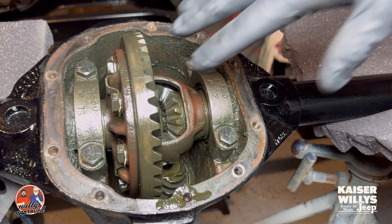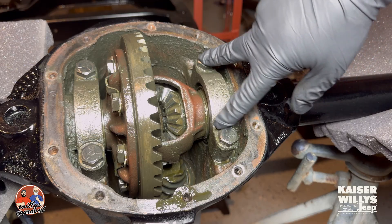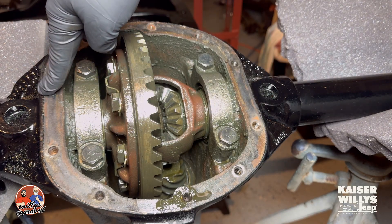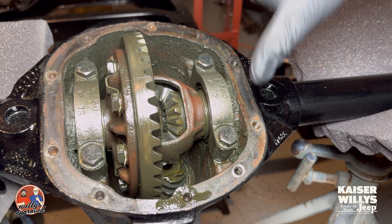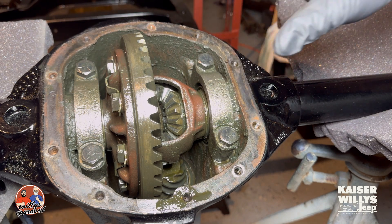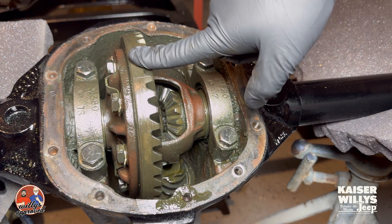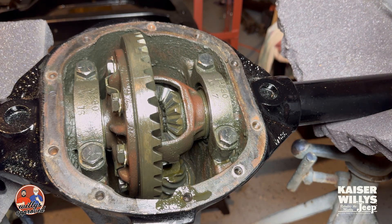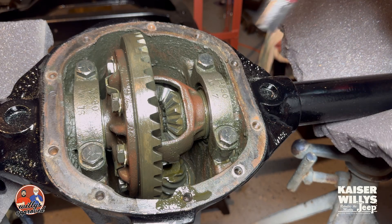This carrier is being held in by two collars, one on both sides. The orientation of the collar is important, so what I would say is before you do anything, take photos. I do that anywhere and everywhere that I do any sort of building or taking apart. So that being said, we've already taken a photo and we're going to go ahead and remove these collars.